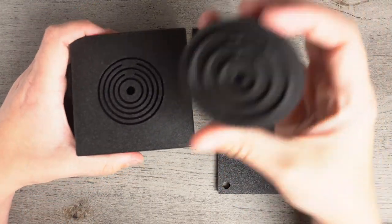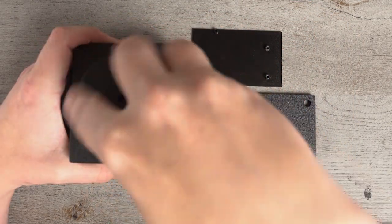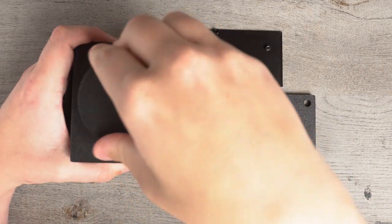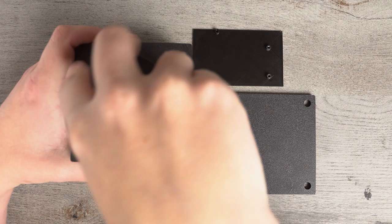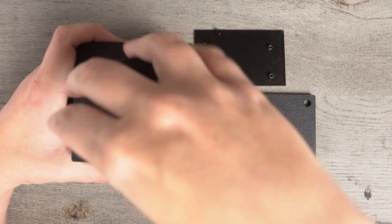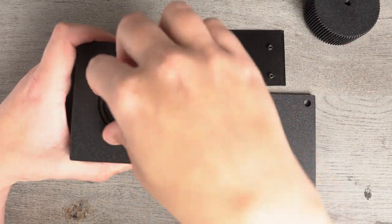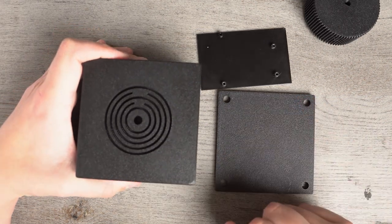One thing I would recommend as well is, after you print the box and the gear, before you start building things, take the gear, put it into the threads and give it a bit of a spin. That way the tolerance can wear down a little to where it's easier to rotate, because depending on what material and settings your printer is using, it can be hard to turn the first few times. So giving it a little bit of time to wear in before you build is helpful.